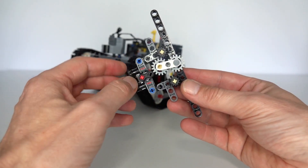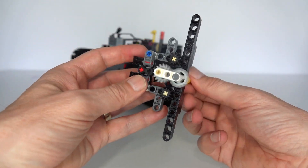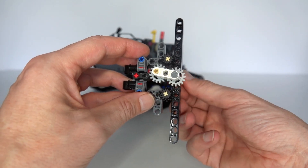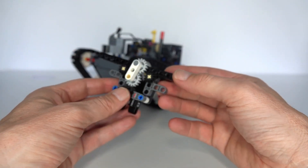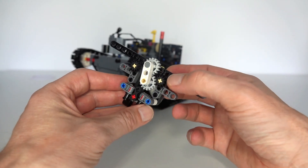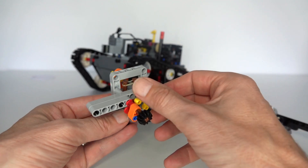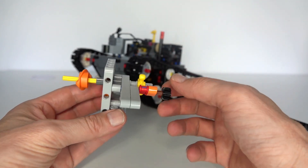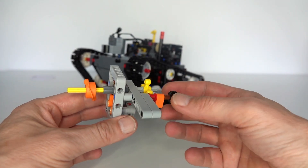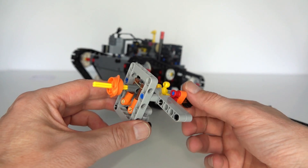I've got a small rubber piece — a Lego Technic piece — that allows this mechanism to work in any direction relative to gravity. That little gear connects onto the rubber piece and pushes off it to connect to the top gear, independent of the direction of gravity. I use the forward direction to drive the output and the reverse direction as a function selector. That right output connects to a function selector — a knob wheel with a stepper that only allows 90-degree steps, giving a rotary catch that can go into four different 90-degree positions to implement four different functions.